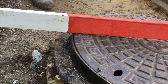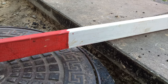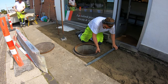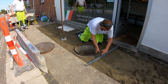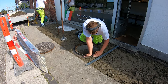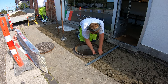After that I set the manhole at the correct height by using a straight edge, and I try to find the perfect level between the stair and the tile sidewalk, making sure there is no gap between the straight edge and the manhole. In this case I use concrete beneath the manhole to make it level, but ideally it would be a plastic ring that goes underneath the manhole and lifts it depending on how much you need. It is especially useful if there are heavy cars driving over the manhole, but in our case the client did not want to invest more money into the project.